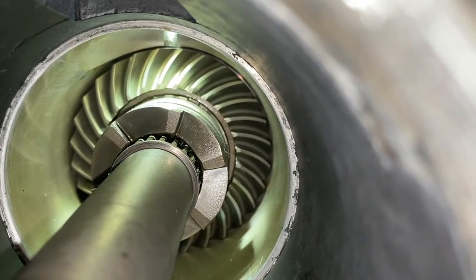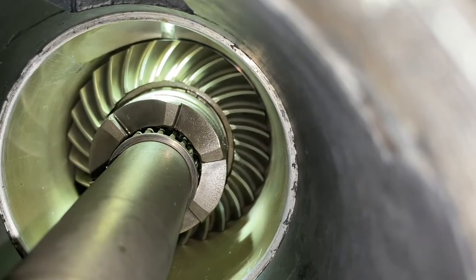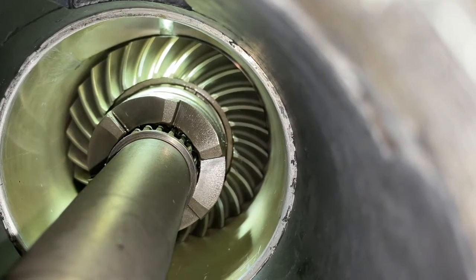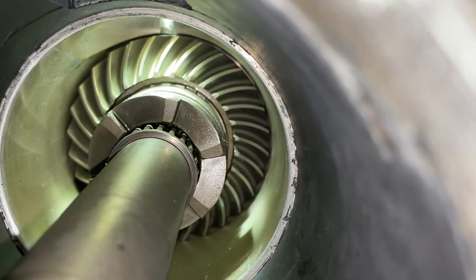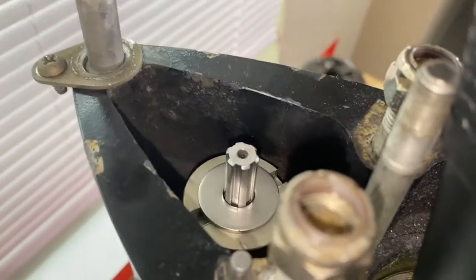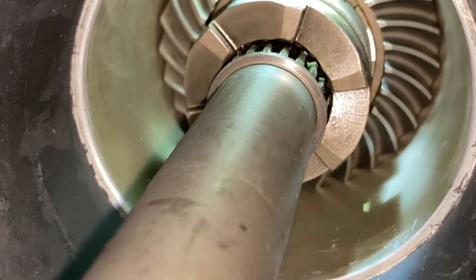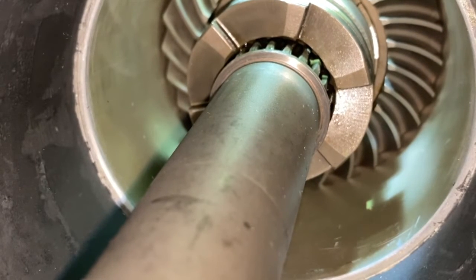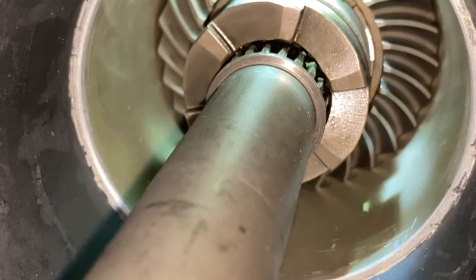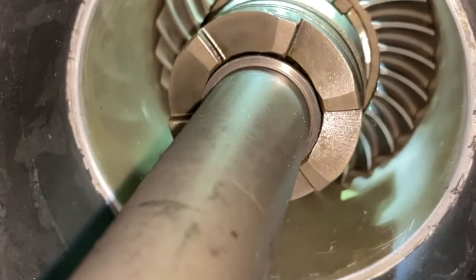Coming back inside, there's a better view of it and so far, so good. We're not actually going to cover the shimming process because we did not pull the bearing race or carrier that the bearing on the backside of that forward gear seats into. Our serial number engine may be different than yours, so it is extremely important to reference your service manual or owner's manual for your exact serial number engine. What we're going to do is come up top and rotate the shift shaft to ensure that the clutch dog inside shifts back and forth, as shown here. First, ensure the propeller shaft is as centered in the lower unit cavity as possible. And that is exactly how it is supposed to work.